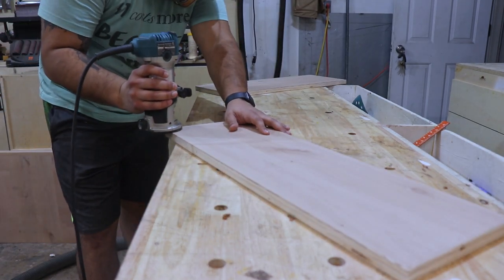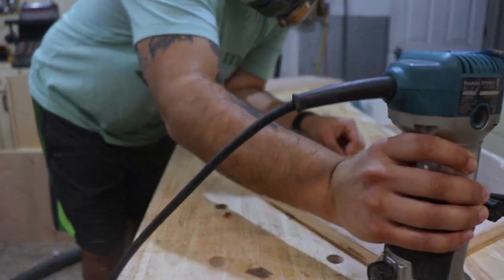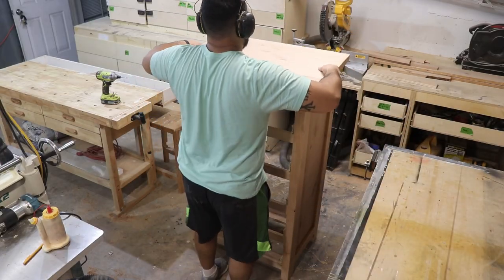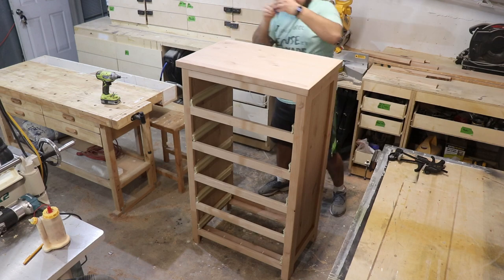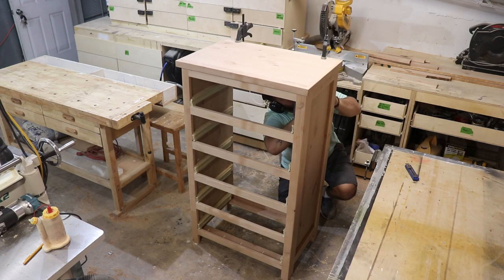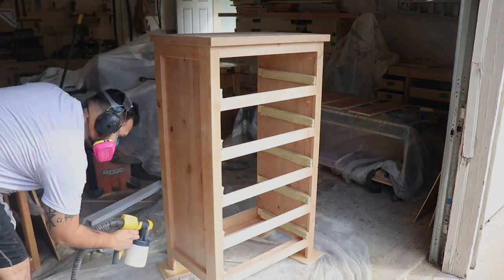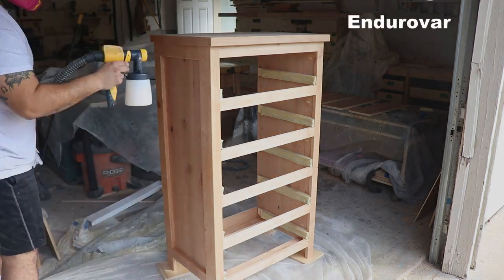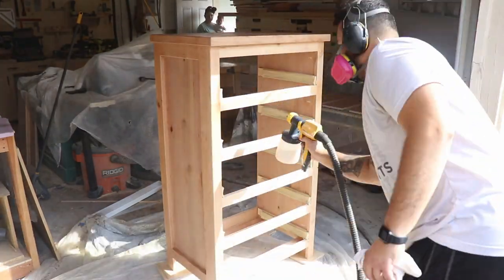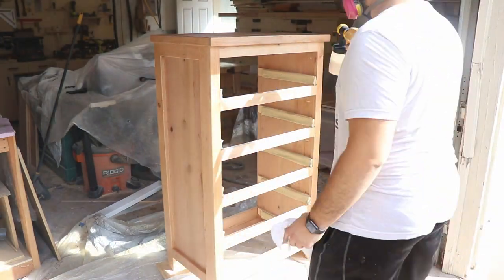For the drawer fronts, I'm just using plywood — that's what I did for my daughter's dresser. If you haven't seen that video it's on my channel. I really like the look of that front: veneer alder with the exposed plywood edges, a nice roundover, and then finish. For the finish I'm using General Finishes water-based — the name's escaping me but I'll put it on screen. I love this stuff; it's expensive but it sprays very nicely.